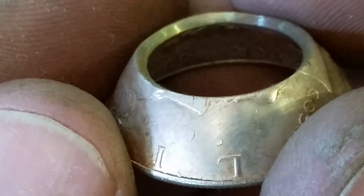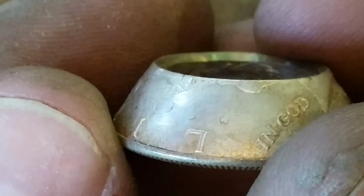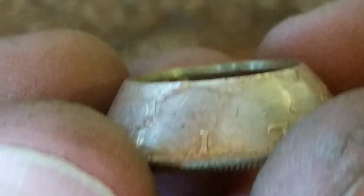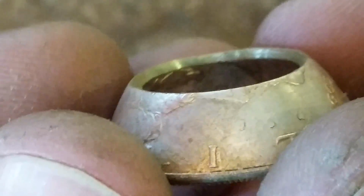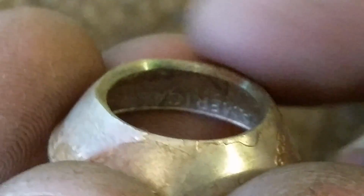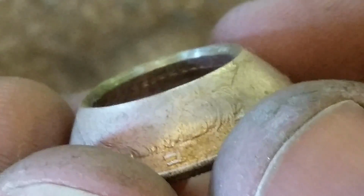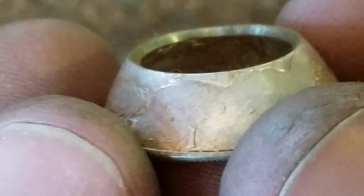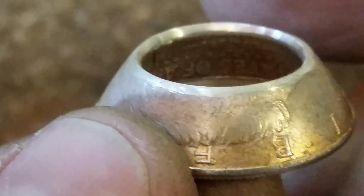And you can see it here at the rim too, up top. So that is why we've got to be very, very careful in annealing. I'm already creating myself problems. No good. Now that I've recognized there are some little miniature problems on there, before I do any more pressing, I'm going to re-sand that, and then I'm going to even bevel this edge a little. Usually I do it before I start stretching, but I'm going to do it early now because I can see I'm already starting to have problems. So we're going to do that, and then we're going to go to press.